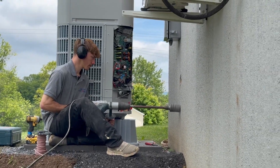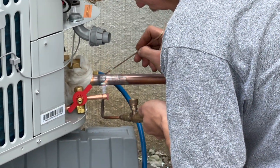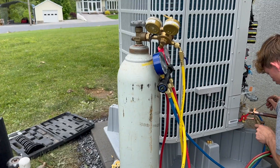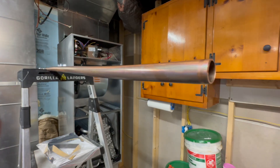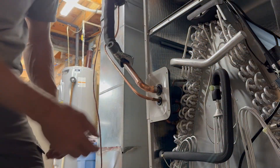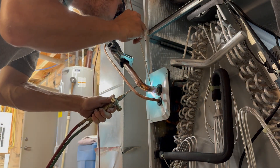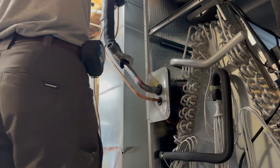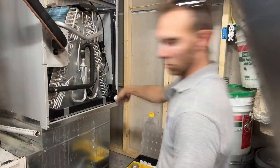Cadence is now drilling a new hole for us. We didn't really want to drill another hole in these superior walls, but ultimately to finesse this job much nicer, we felt the need to go ahead and drill another hole. A quick check of the nitrogen purge and we're off to brazing. We purge into the coil on the liquid side and out of the coil on the vapor side to draw heat out of that coil.